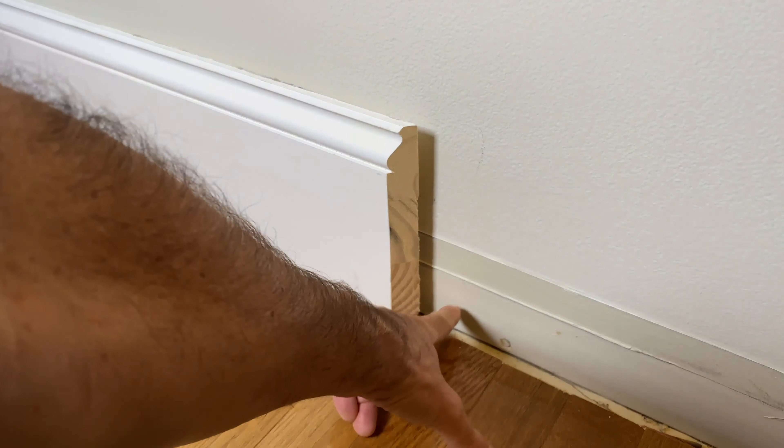To cope this, you cut where the wood was cut at 45 — you cut along the profile line, all the way down, making that silhouette shape so that the face is cut off straight. What happens then is it butts right into the next board. On the straight part you can cut most of it on your chop saw until you get down to the curved profile point, and then finish the rest with a coping saw.